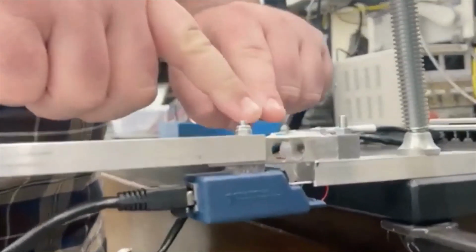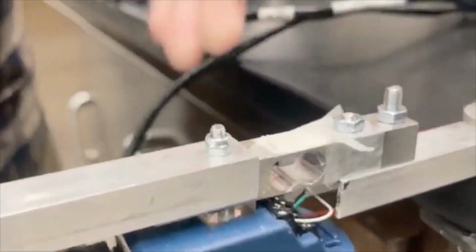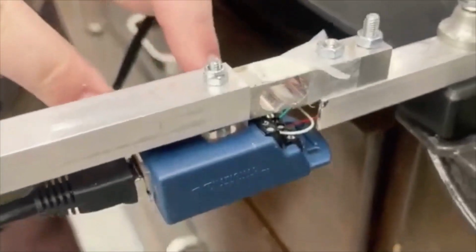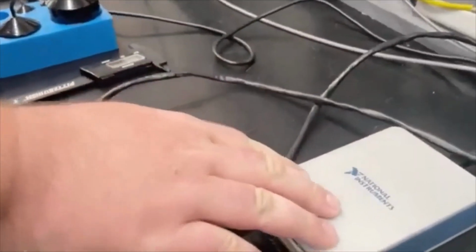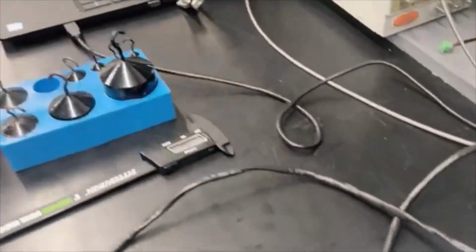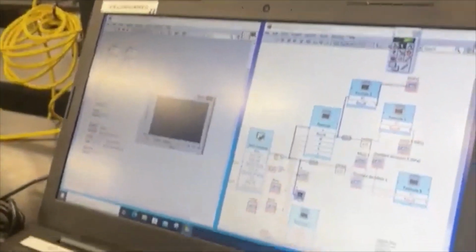Right here, you have two strain gauges on top and two strain gauges on bottom that are covered by a special adhesive that then run into a Wheatstone bridge that we're using as a full bridge circuit, that then runs to your NI DAQ device that will then run into your computer, and where you have the different masses. This is the experimental setup. Since we already have a mass loaded on the beam itself, we can go ahead and hit run.